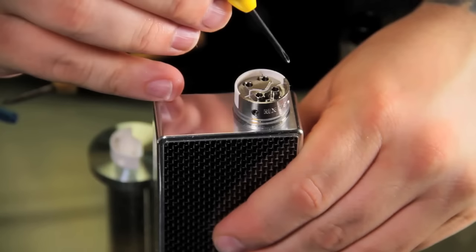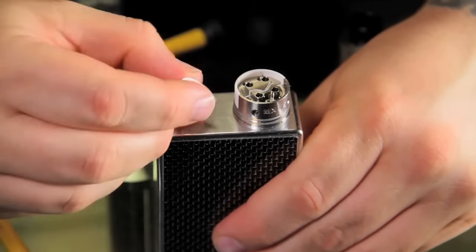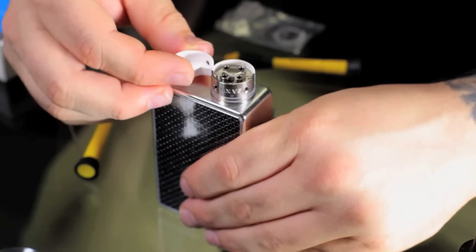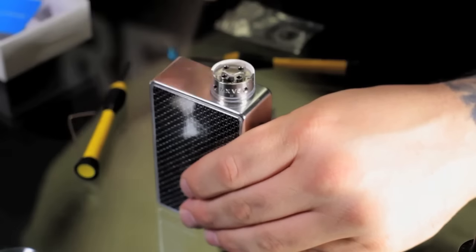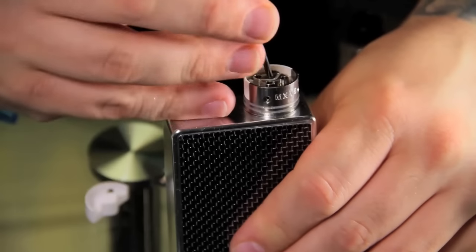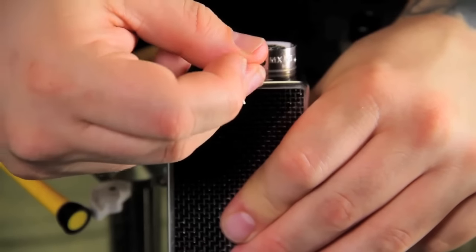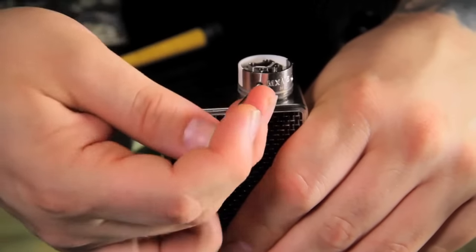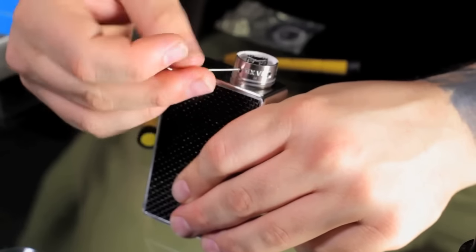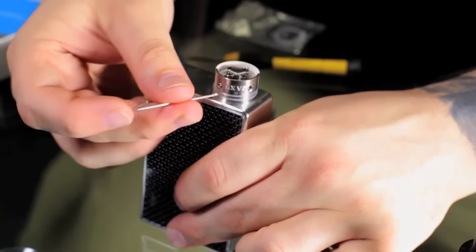You can see you do get your little ceramic insulator I mentioned — that part right there. There is a little center section there I can show you as well, how to take that off and get to that ceramic. You get your adjustment before your leads — your leads go in there and there's a little Allen key slot in there for the adjustment. You just get it out just like that. You just run your leads in there and tighten that screw back down.